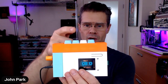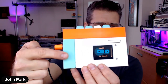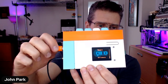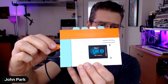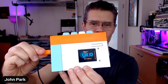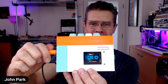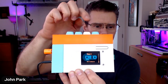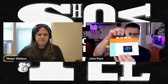I've also got a volume knob here — a little rotary encoder. These are some of our NeoKey switches. If I go ahead and hit play, you'll see a progress bar marching across as the song plays. And if I tweak the volume, you'll see that vertical progress bar. One thing I can't stand is when rotary encoders are used as volume knobs on car stereos instead of potentiometers, and they don't have enough granularity — only like 10 steps. So I made mine have a lot of steps for adjusting volume.